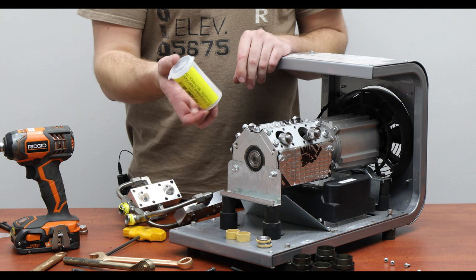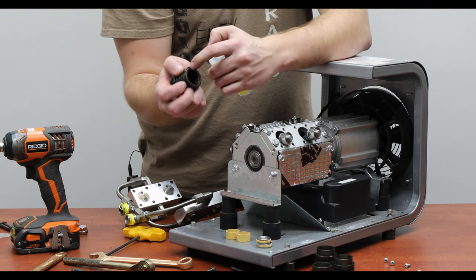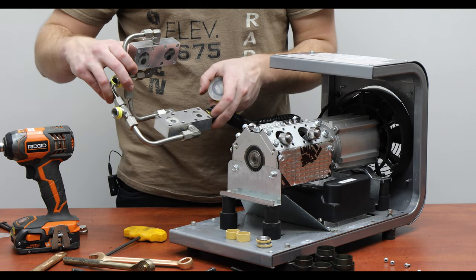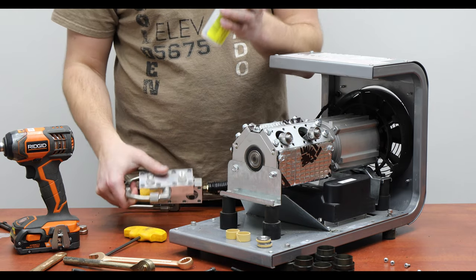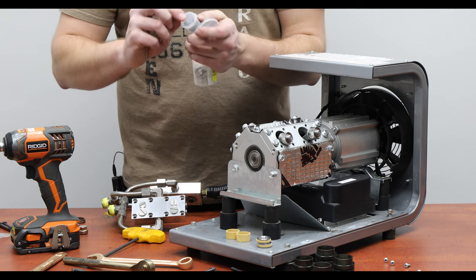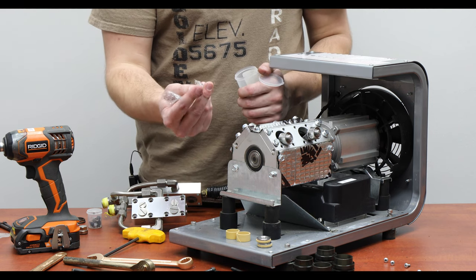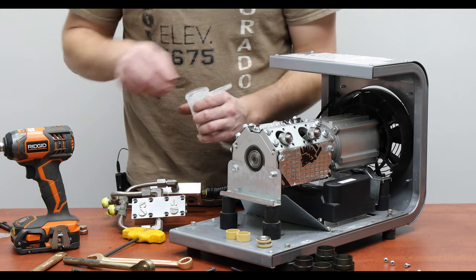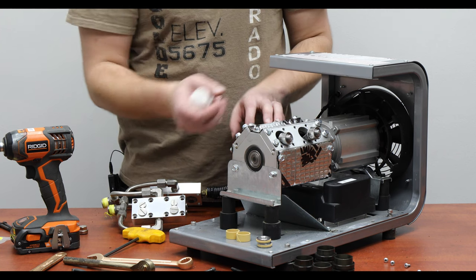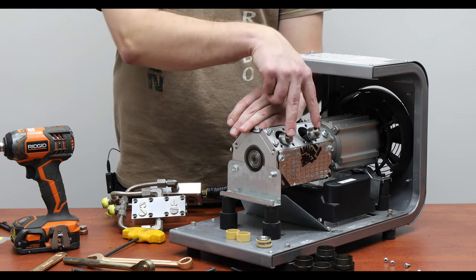We do have some other rebuild kits available. One is for the O-rings and stuff inside the top end — that'll include the O-ring inside the top of the cylinder, along with all the valves and O-rings in the two heads. You can see there's an in and out valve in each piston, and that can be replaced with this kit. I won't be doing any of that today. Now what I do need is the BVB-3 rebuild kit — I'm going to have two of them for this four-cylinder pump. The two-cylinder pump is the exact same thing but cut in half — you only have two cylinders, so you need just one kit.